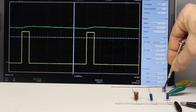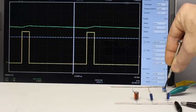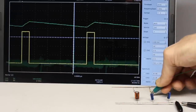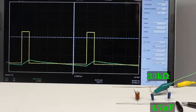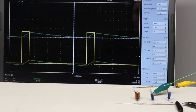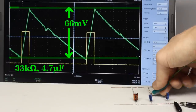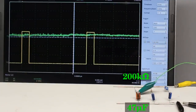If the resistance of the potentiometer is increased, the ripple decreases clearly. We can detect a ripple of almost 70 millivolts at the output of the middle filter, consisting of a 33 kilohm resistor and a 4.7 microfarad capacitor. The ripple of the left low pass composed of a 200 kilohm resistor and a 47 microfarad capacitor is lower than what can be measured with the oscilloscope used.